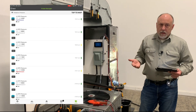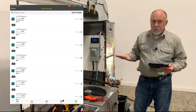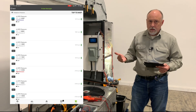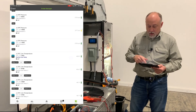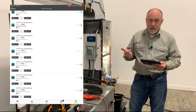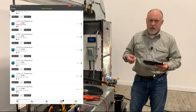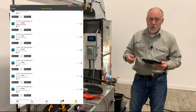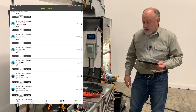These are really working well — this is quite a few probes. Right now all this works off FieldPiece only, because you have to have so many probes connected and FieldPiece beacons their signal. Because they beacon, we can see all those coming in. You can see how fast those are coming in and updated on the iPad display. The green represents data that is less than one second old, so they're coming in very quickly. I think these read about four times a second, so even with all 20 probes, as quickly as they send signal, the iPad picks them up.